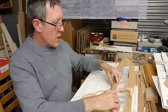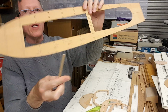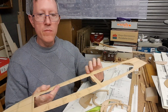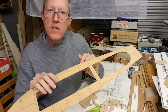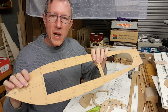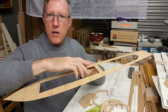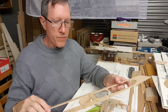Now you might be wondering, well, okay, if you cross brace those, then when you eventually get your deck on, you're going to have these extra bits of wood when you in fact needed access inside. But that's only a temporary thing. Once all your planking is done and you've got a completely rigid hull, you can then just take your little saw and cut those out again. It's almost just a building aid.